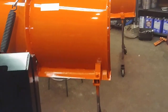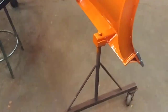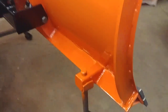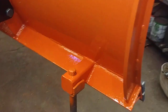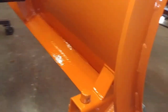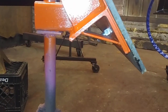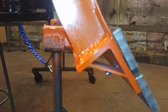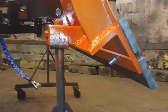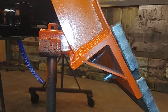One of the other things you'll see in the configuration is the foot pockets are a little different between the two. All of our plows get the same foot pockets—these are sitting on stands for having been painted, that's how we paint and assemble them. So all of our plows always have the foot pockets. But the first thing you'll notice: this one's closed in and has no supporting gusset, whereas over here we've got a supporting gusset and it's open. The main reason you see that support gusset is because on our lightweight plow, the angle iron is one-quarter-inch thick, three inch by three inch, and the skin overlaps it all the way down. On the heavy-duty, that angle iron is substantially heavier—that's a three-eighths wall, three by four angle iron on that bottom frame. So there's no reason for that little kick gusset because this angle iron can take all kinds of twist force, but notice our skin stops part of the way down.